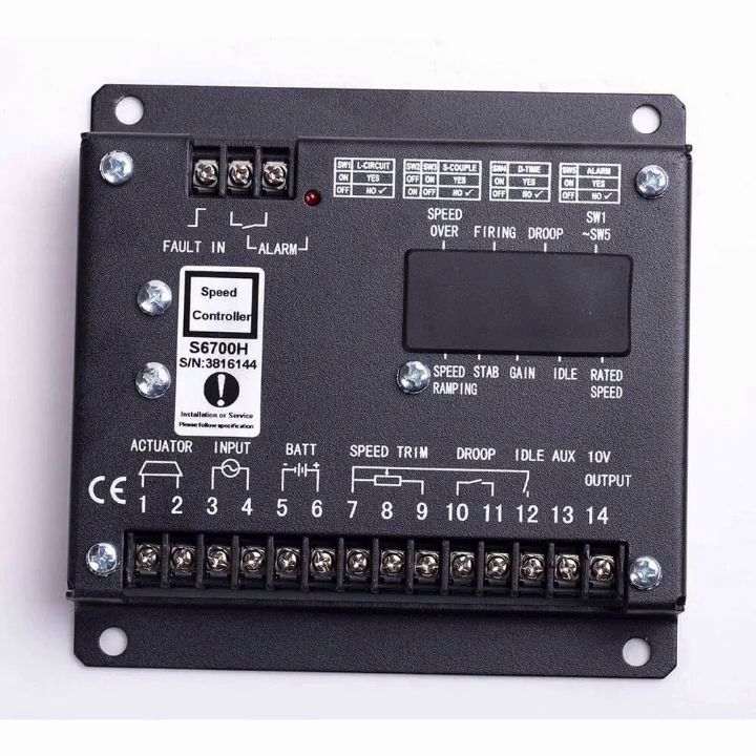On the upper left side there are only three pins for fault and alarm. This is the fault and alarm mode indication light — when some fault occurs in the controller or in the generator, this light will blink to tell you there is a fault. You can also use normally-closed and normally-open switches for the alarm and fault outputs.